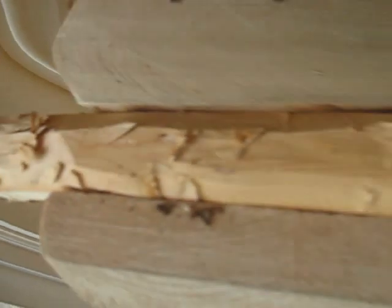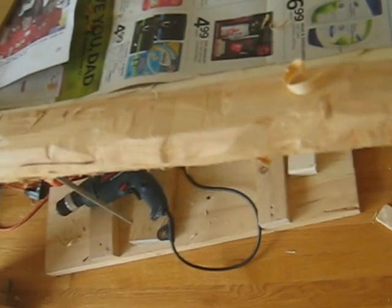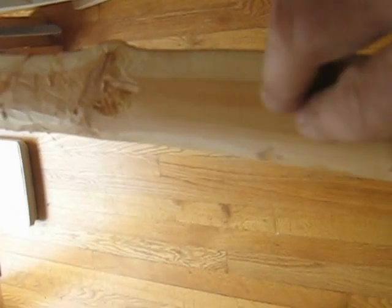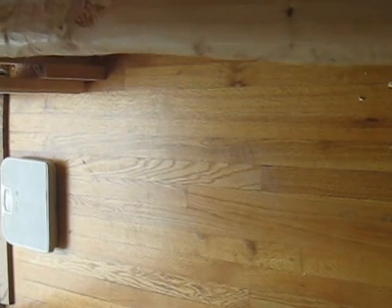And then I'll have something I can really work with, but to get there I've got to clean it up. You can see along the length of it — I just chopped this thing out with an axe. I was in quite a hurry actually. I took a whole bunch of these staves and did exactly this to them — chopped them down to rough two-by-twos and threw them in the closet. So now I'm getting to work on this one a little bit, doing a stage of the work. And I find that the spokeshave that I just trimmed up is working great. I didn't even resharpen the blade — I had sharpened it previously, hadn't used it for a long time — and now with those little improvements that took about half an hour, I'm getting beautiful cuts.